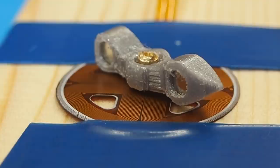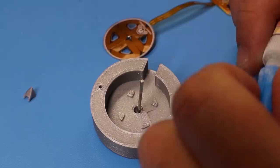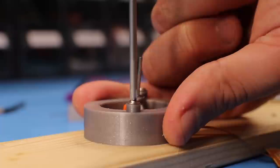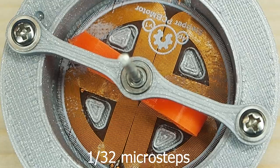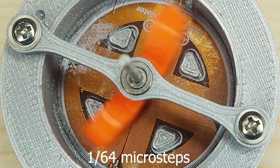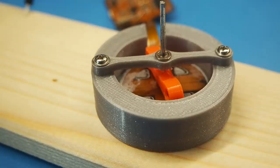While testing this new rotor idea I noticed another problem — the shaft had some wobble, which I think was coming from the fact that it was soldered onto the flexible PCB. This is the third reason why having this motor made from a flexible PCB was a bad idea. To stop the wobble I designed a 3D printed holder which I glued into the PCB stator, and this time I also mounted two bearings to hold the shaft steady. Mechanically this was much better, but the angular positions were still not equal even for different microstep settings. I did find a mistake in my schematic — the datasheet specifies that the current sense resistor must be carefully selected, and I was using the wrong one. But when I changed the resistors to the correct value, the same behavior was observed.